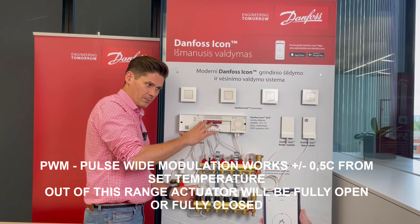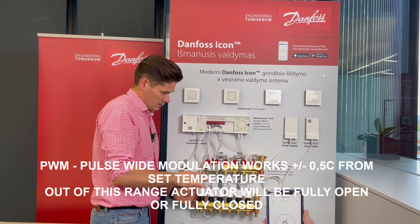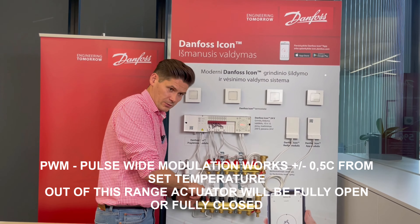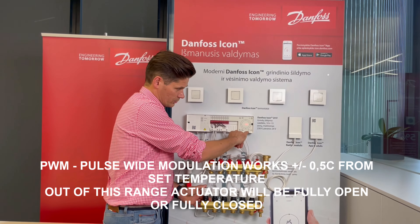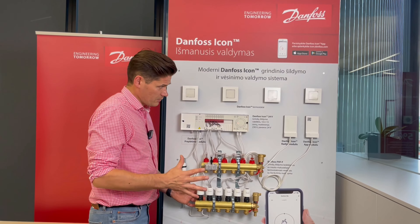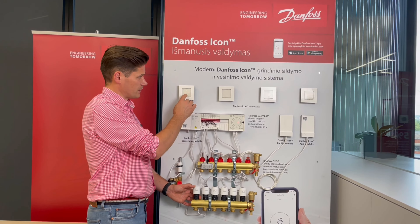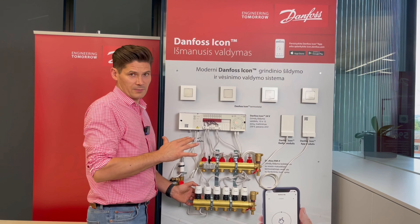So that's how the whole system is set up. There is some more functionality: slow, medium, fast. I can select, for each actuator, which mode it is — slow, medium, or fast. Slow would be if you have floor heating pipes in concrete. Medium would speed up a soft system, and fast would be if you connect radiators to your floor heating manifold.